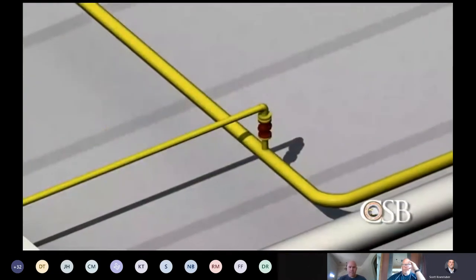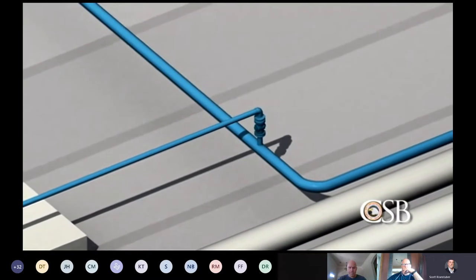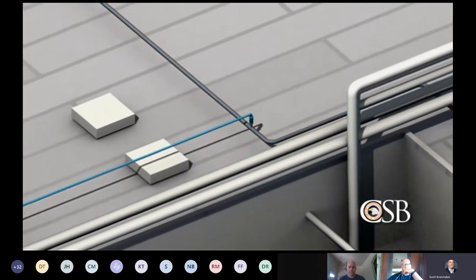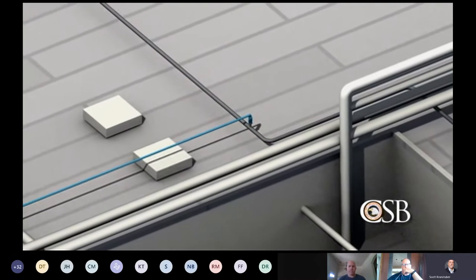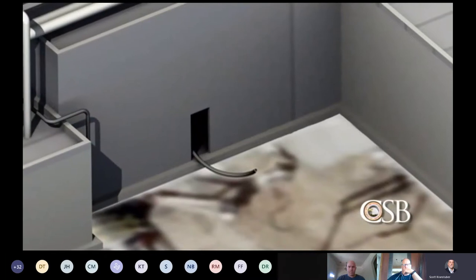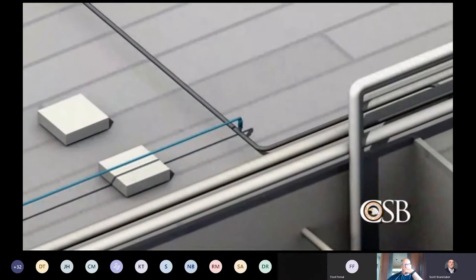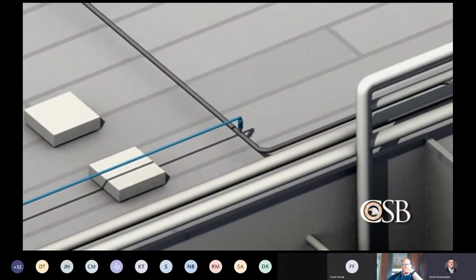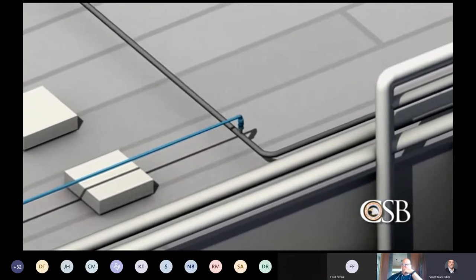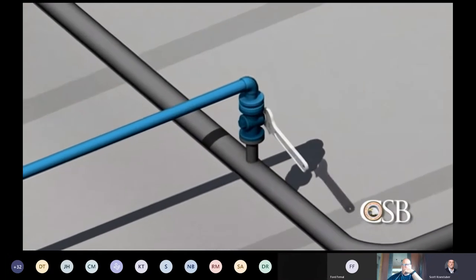The new gas piping was pressure tested with air to check for leaks, along with the existing supply pipe. No leaks were found. ConAgra employees then used natural gas to purge or remove air from the supply pipe prior to use. Attaching a temporary hose to the supply pipe, ConAgra workers vented the flammable gas directly outdoors. However, they did not purge the air from the new steel pipe leading to the water heater. On the day of the accident, an ESA worker was attempting to remove air from this new piping prior to lighting the heater. But ConAgra did not always require piping to be purged outdoors.